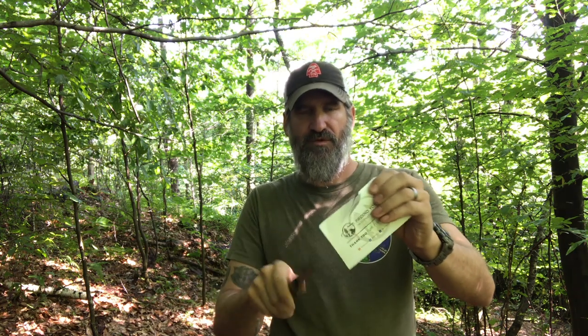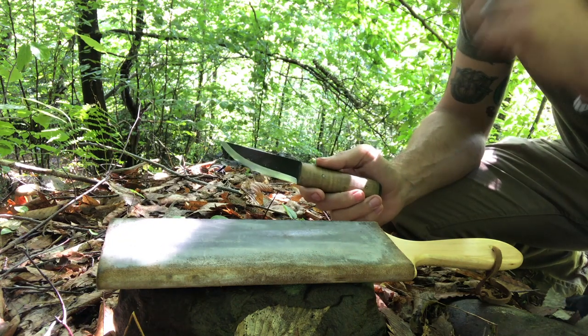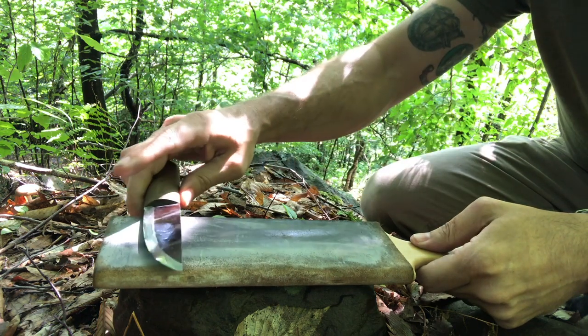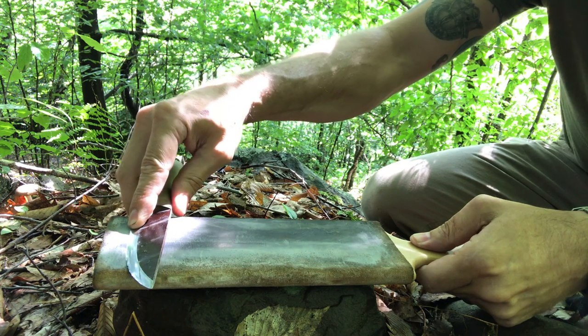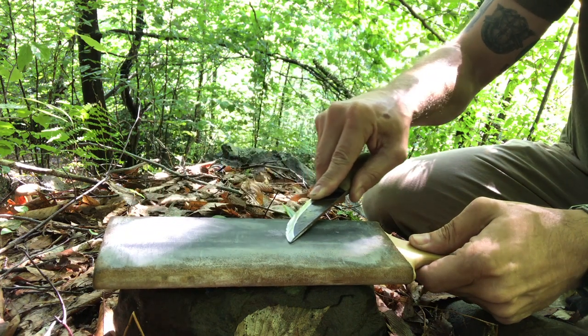Keep in mind this Pucco is already fairly sharp. What I'm doing is maintaining the edge with just a little touch-up, just a honing, just a polishing of the edge. But it still catches a little bit — one of the drawbacks to the full Scandi is it has a more delicate edge because it doesn't have that secondary bevel. But I prefer the precision I get out of that over a secondary bevel. Now sometimes in the field it can be a little difficult to find a flat surface to put your strop on, but if you do have a flat surface to use that will help stabilize it. The technique is not much different from when you're in the shop: you find and index that bevel, and then while you stay on that bevel you drag the knife across the strop and follow that curve all the way up to the tip.